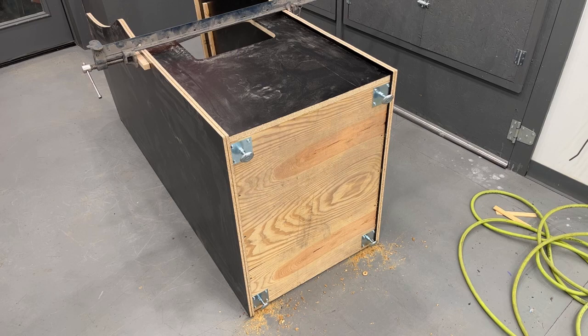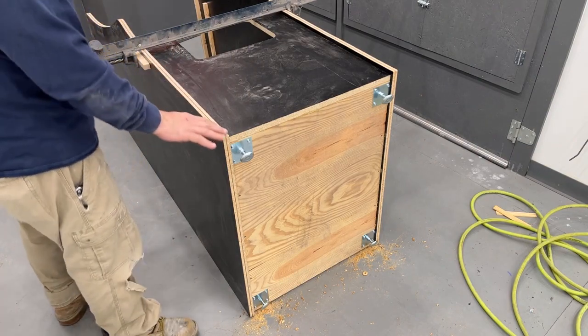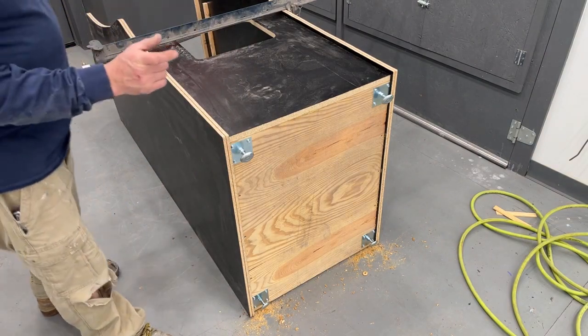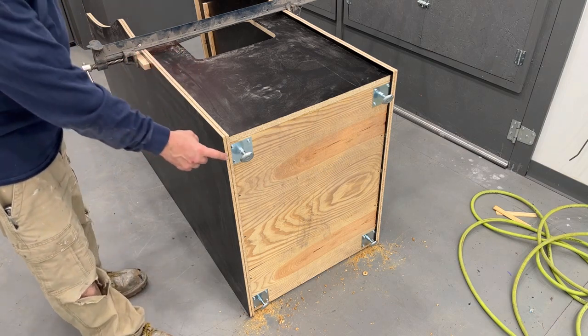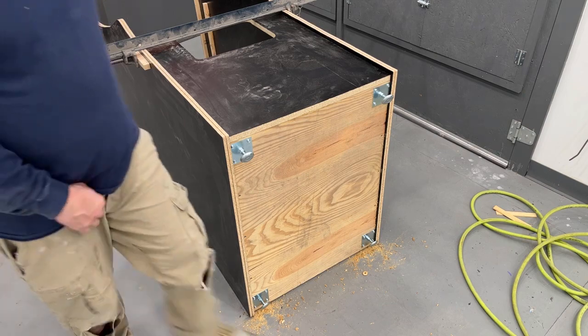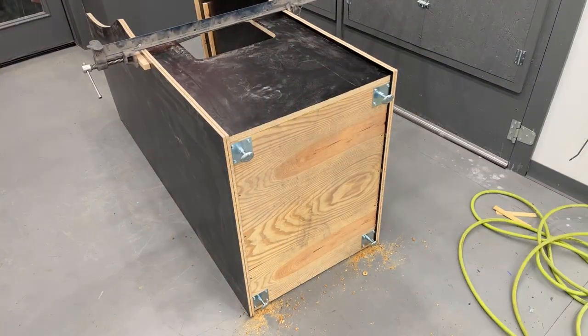Before, when I was cutting the sides and I routed my T-molding groove all the way around it, I forgot to mention, I told you I ordered the light blue T-molding. So the light blue T-molding is going to go from about here all the way around and a little bit around on the back side. Then I just take straight black T-molding and I go along the bottom and all along the back. I just think it looks better, when you do a colored T-molding, to not have it on the back edge. Just leave it black like it originally would have been anyways.